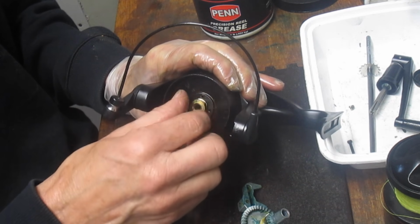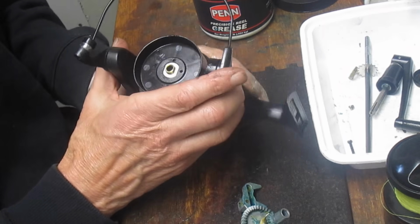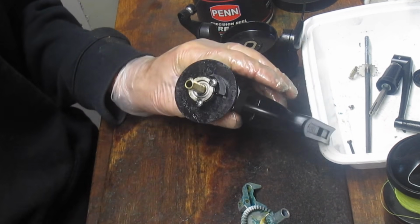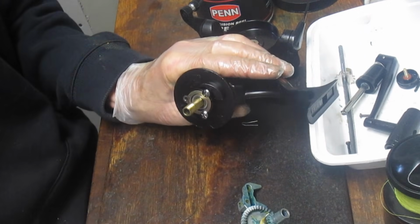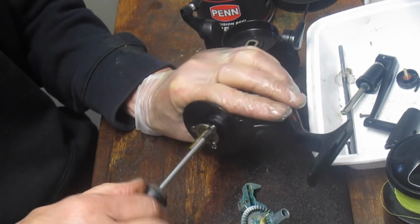We're going to remove that counterclockwise, so that's a traditional threading on this. There are some rotors that don't have traditional threading, you go against it. Might as well pull them out. There's 3 screws here that hold a collar, and those collars hold the bearing. So again, right on my table here. These are steel screws. They're not stainless steel screws.